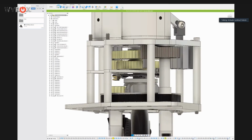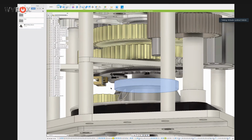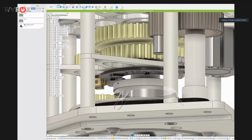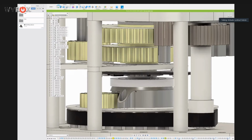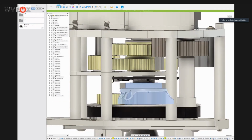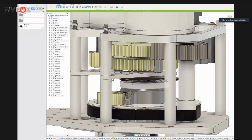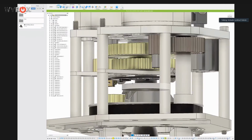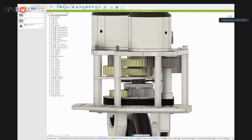So here we've used a Lamprey encoder, which uses a magnet, and that's how it picks up its rotation. So there's no mechanical connection between these two parts, and we've almost completely avoided putting load on any sort of 3D printed parts. This is a 3D printed adapter that attaches to the pulley, similar to the Mark II, but here it's just holding the magnet and it's using that to find its position. And it's still absolute, so we still maintain that, which is very good.